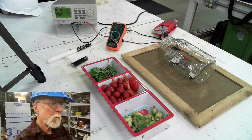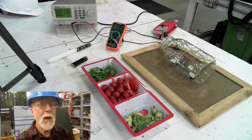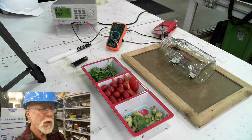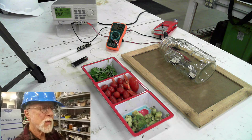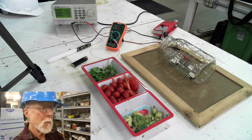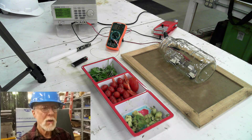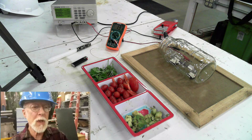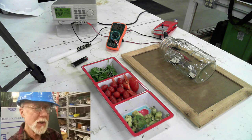Then I put 120 psi of air into the tube, and I put a coil around it and heated it up to about 700 C. And I saw the pressure go up to almost 200 psi. That pressure held for many hours at that temperature and didn't leak out. So with those two tests, I'm confident that this sealing method is a good one. The only doubt was because hydrogen is so prone to leakage. The molecules are so small that it will leak where nothing else will. And so this is an important last test to confirm that this sealing technique is a workable one for these kinds of reactors.